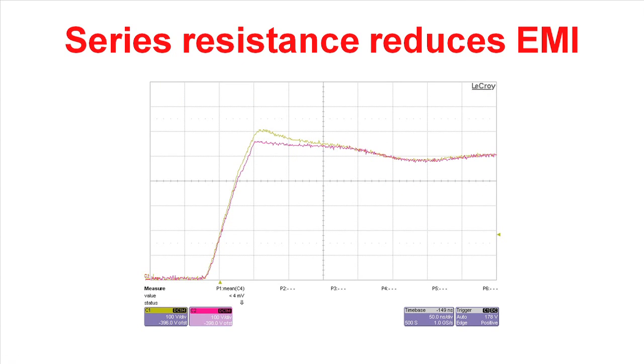In this next picture, we've added the resistor in series with the diode, and now we have two different waveforms. The first one with the flatter top is the Zener voltage, and you can see that the Zener does a pretty good job of maintaining the voltage at a constant level. The second trace is the voltage on the drain of the MOSFET, and you can see that there is some voltage across the resistor in our snubber. You can see the current decay and then go to zero, and then the drain voltage rings a little bit. The reduced ringing is due to the resistor, and this will minimize some of the EMI in the power supply and provide less noisy operation.